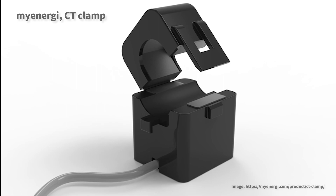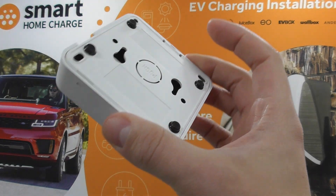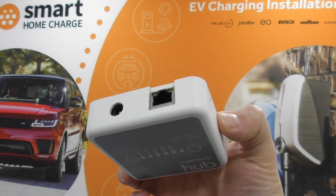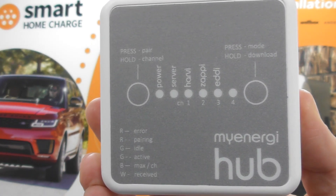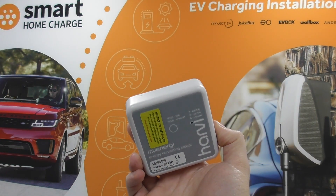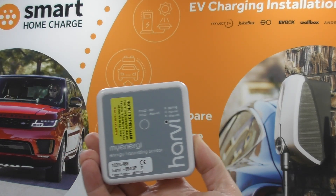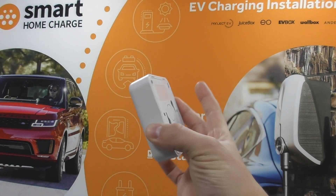Additionally, if you have other products connected to the MyEnergy ecosystem, such as a battery storage device like the Tesla Powerwall, you will need a third CT clamp. If you're not sure what equipment you need, please contact the MyEnergy technical support team. To be OLEV eligible, the Zappi must be ordered with the MyEnergy Hub, which communicates with the entire MyEnergy range of products. For example, if you wanted to order the Eddy product, which uses surplus renewable energy to heat your water, the hub will communicate with that device. You can also order the Harvey, which works alongside the CT clamp to communicate with the MyEnergy Hub — this can make installations a lot easier, but it's not strictly necessary and is a separate order.